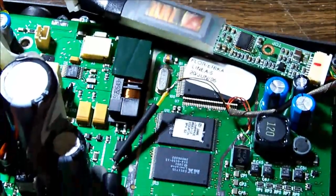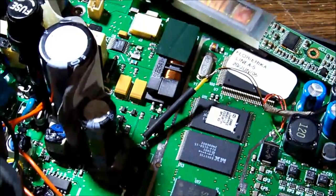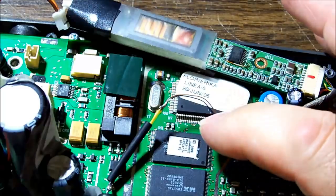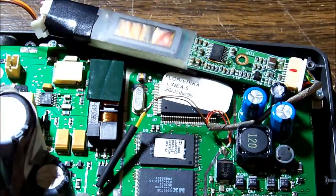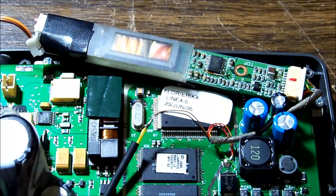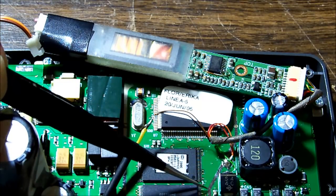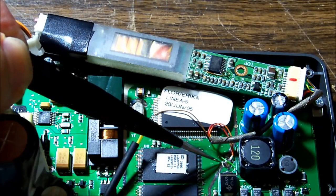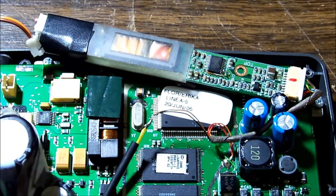Alrighty, we are wired. I did run over to the inductor in the middle here. It was the best choice to make sure I had enough power, although I don't think it uses a lot of power. The wires that originally go to it are extremely fine, but that will be okay. I've tapped off the end of this diode for the 5 volt, and beside there's some unmasked line through there where they probably intended to put on a metal shield and never did, and I've just connected the ground, soldered that to that line, and I guess, yeah, we're ready to try it.